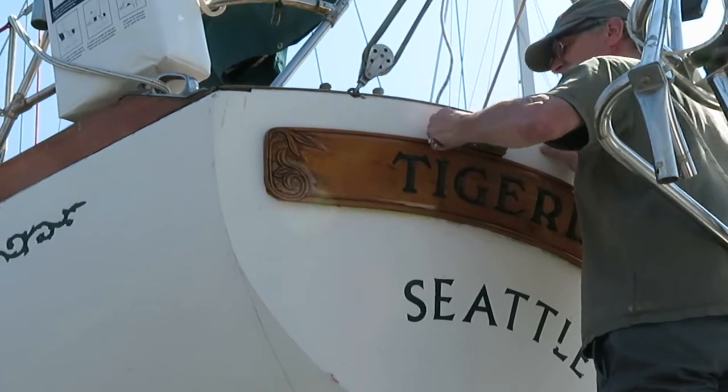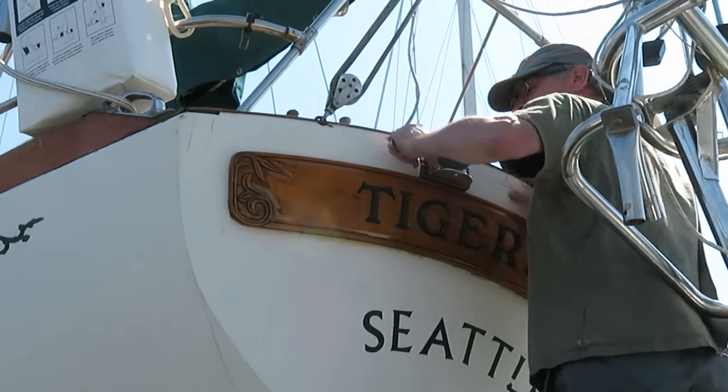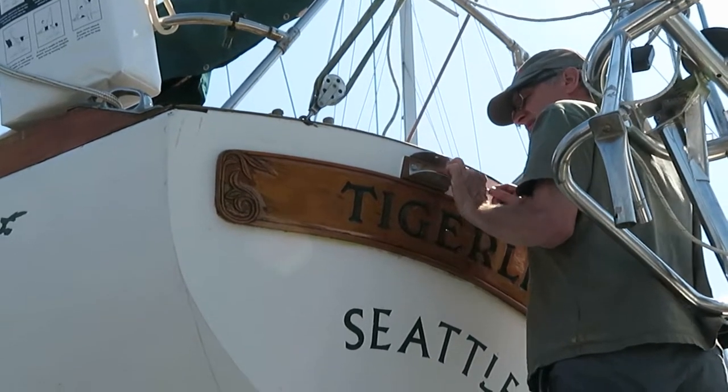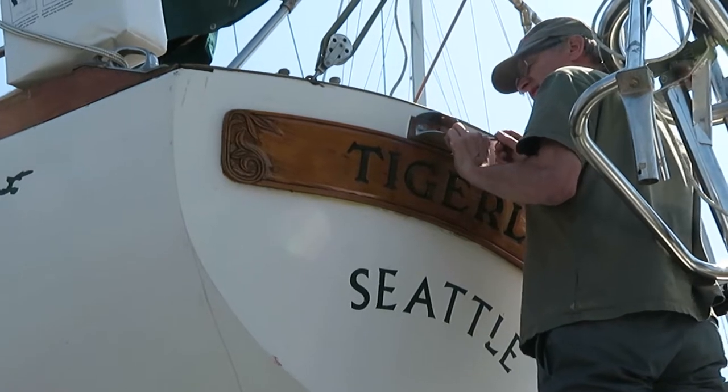At this point, the holes are drilled for the upper mounting brackets and 5200 sealant has been applied to make sure everything stays watertight. I'm currently underneath the transom doing some boat yoga, trying to get underneath and around the aft bench seat so I can install the fender washers and nylock nuts on the other side.